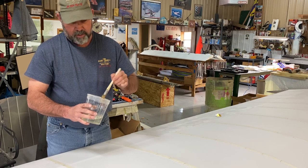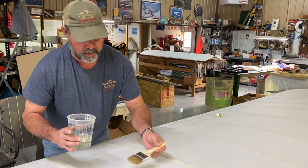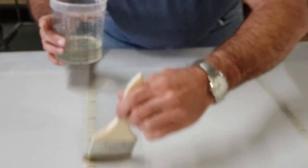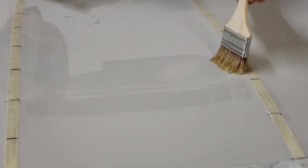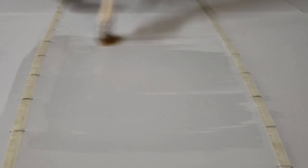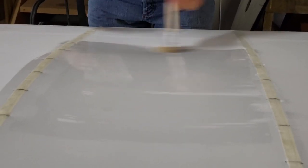What I do with one of these brushes is everything pretty fast. I start out and keep it pretty close, wet down that rib side pretty wet, and then you're looking at the light. As soon as the brush gets a little dry, back up and go again. Back here where I'm dripping, I'm going in this direction. I don't like to drip on something I've already done because when all the reducer dries out, that drip will make a little ring of glue.